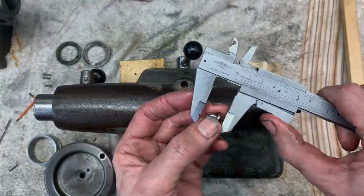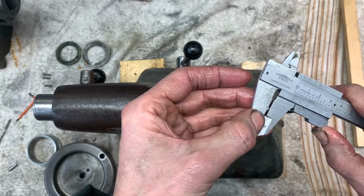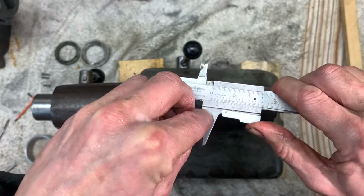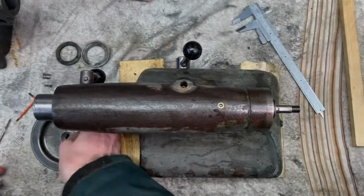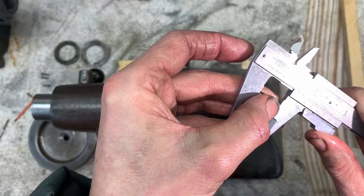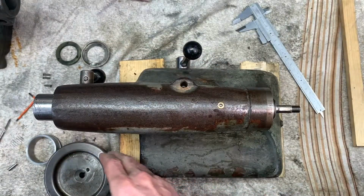The little stubby is just over 400 thou long, about 59, 60 thou thick on the head. Diameter of the main part of the head, about 370 thou. A little spindly bit, just over 180 thou. Same diameter, and the length of this locker, the pusher, is 700. So this stalk part here is a nominal 3/16.